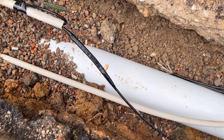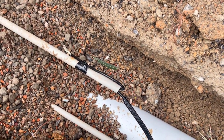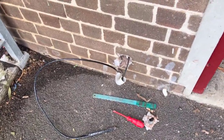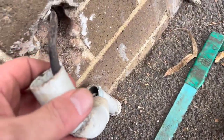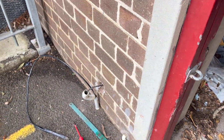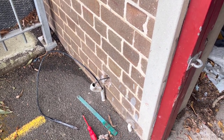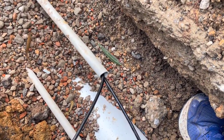I've taped my new cable onto the damaged cable. Because I can pull them through one at a time, I've put some tape around the second cable so it doesn't pull into the conduit and I lose the end of it - that's pretty important. Unfortunately nothing's ever that easy in life - there's a 90-degree bend down under here, which comes to a bend here, going to another bend down there. Basically to get it through you need enough length and then put it in through the wall, but the hole I have is just way too small.